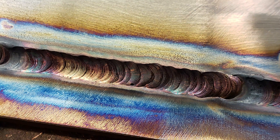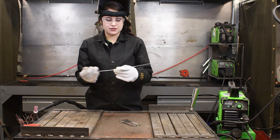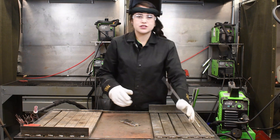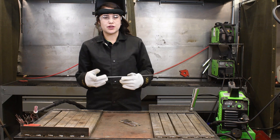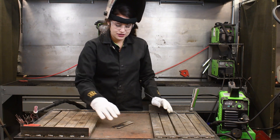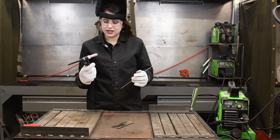We're still a little concave, so what I'm going to do is go from this 1/16th filler and we are going to mess around with this 3/32nd filler rod. With that being said, I'm going to actually go up to closer to 95-100 amps, just because it is going to take more heat to actually melt this filler rod, and it's going to be cooling the puddle as you're adding it into your weld. So we're just going to finish out this last little bit with our 3/32nd filler.